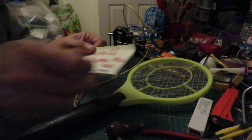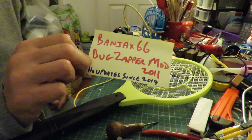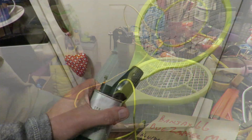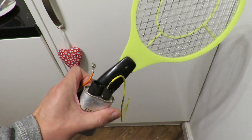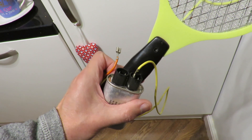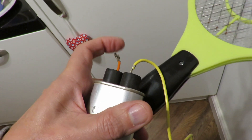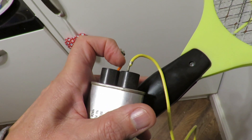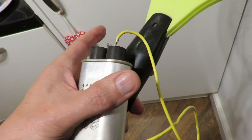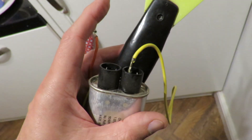So that's Banjak 66's Bug Zapper Modification from 2011. Link will be in the video description. Just a couple of points with this — this is dangerous. That's enough power there to give you quite a nasty shock. The way I've got it wired up at the moment, both terminals are uninsulated, so you could touch them quite easily yourself. So this is just to set it up — this isn't the final version. You'd need to put insulation around it to prevent accidentally touching it.